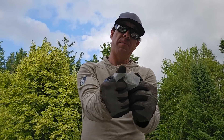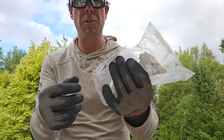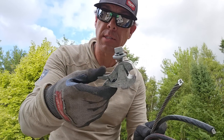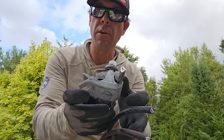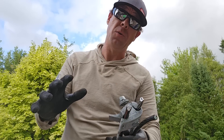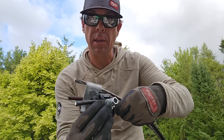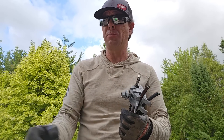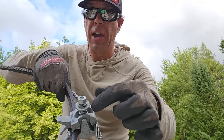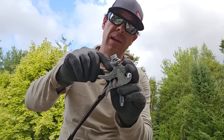Where the price is a little steep, we started trying out the Fast Hat by Burndy. There's a little piece of wire so you can squeeze this, bite the wire, and then the other wire just pops into place — tighten it down, good to go. We've been using these on the bare neutral conductor and piercing connectors on the insulated wire. After talking to the manufacturer, we had them add a shear bolt so you don't have to worry about over-torquing and breaking the connection.